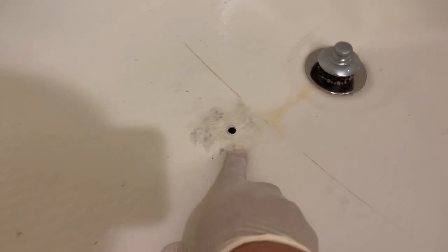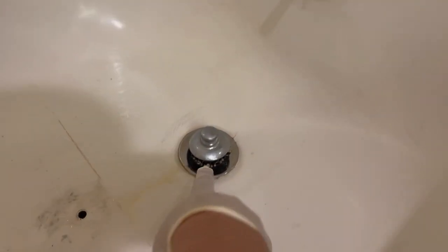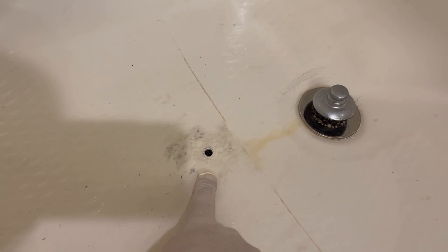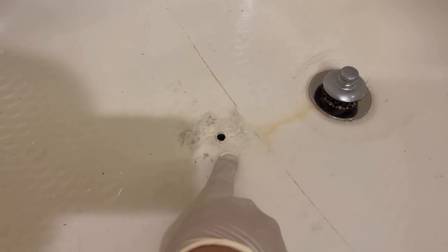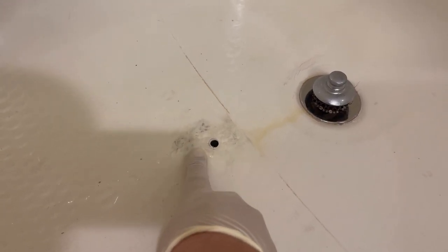There's a hole in the liner here in the bathtub. Reason being is because whoever installed this liner didn't do it right — they didn't tighten it right over here, so water gets in through here and inside the liner. So what we do is make a tiny little hole here. In this case this is a big hole — somebody just went overboard. What I do is just make a little tiny hole. This one's way too big, that's why it created mold around it.